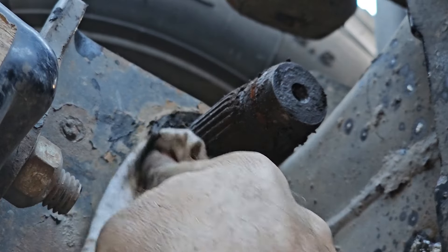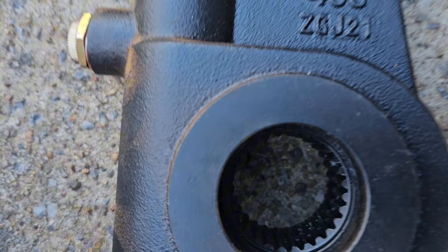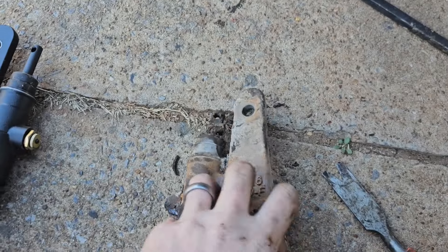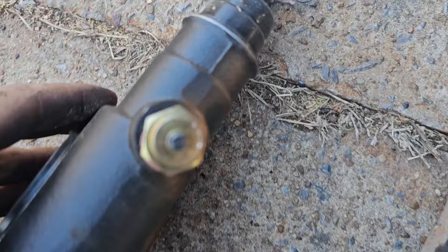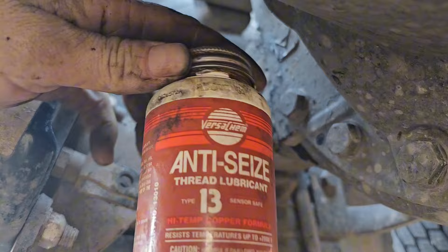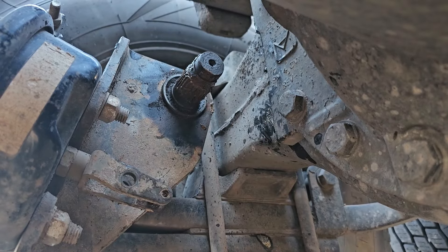Here's a side-by-side comparison of the new one versus the old one. The new one is an in-house brand from Fleet Pride, so it's way cheaper than the name brand stuff like Haldex. According to the guy at Fleet Pride, it's the same manufacturer that produces both, so the only differences I could see were the pull-out tab was slightly different and there were no instructions included. Now I'm just putting some anti-seize on the S-cam shaft — a really good dosage — so this thing will be easy to pull off next time.